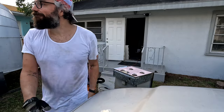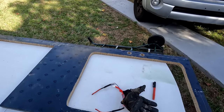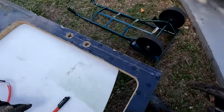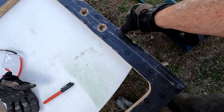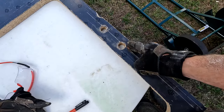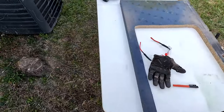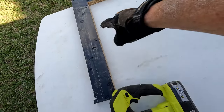Of course it doesn't fit. This is the countertop for the kitchen. The hole where the sink goes is good, but I need to cut out here for the fly screen and it pushes right back. I think the taps are actually going to touch the fly screen at this point, so I need to move these holes forward a little bit - which is okay because there's a plate on top that will cover that.